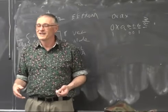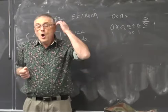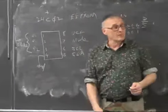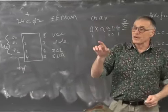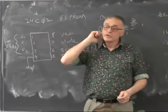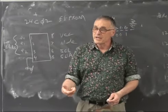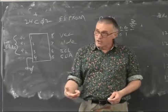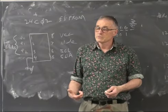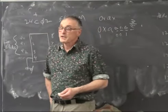So let's say you were going for ranges of data or something. Is there like a burst mode for access? You might have to. And this particular ROM, by the way, does support 8-byte bursts. And so you can put it in repeat mode, give it an initial address, and then do 8 reads in a row and get 8 bytes out. But the Mega's going to operate much quicker than this bus can respond. The Mega is much faster than the bus can respond.